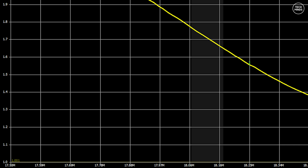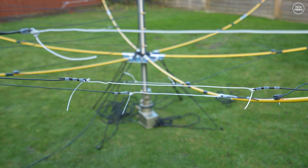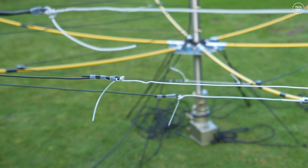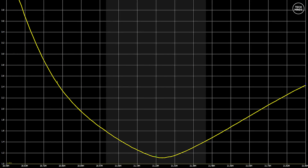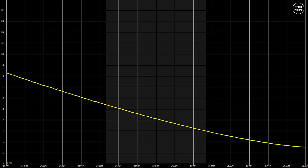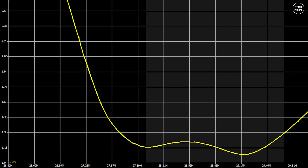The slightly high 17 meter dip could be related to the antenna being quite low to the ground, and also being very close to my conservatory which I presume has a metal frame. Adjusting the elements for each band is super simple since each one is folded back, but I won't make any changes until the antenna is in its permanent location. 15 meters looks good at less than 1.6 across the entire band, and 12 meters is also pretty good at 1.5 or less.